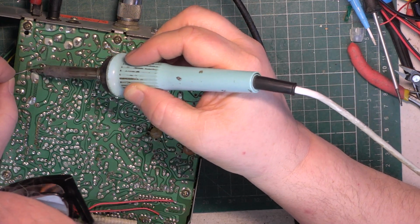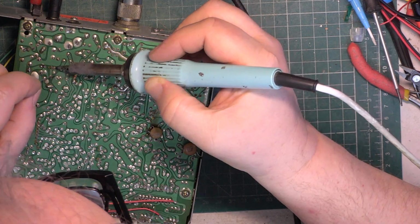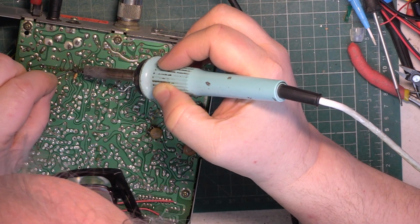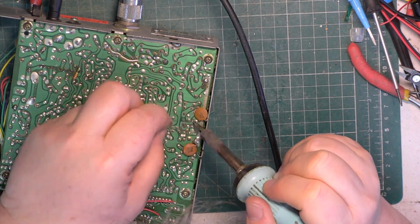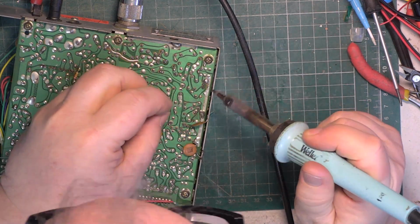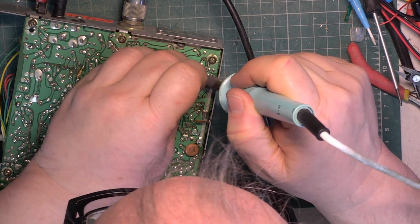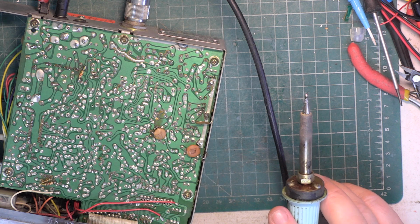You know, I just think this has been used and used until it's failed. In fact, the meter lamp's out. So apart from where the transistors are for the output, which could also go dry joint, hence just checking, that's been soldered up. That filter's potentially dry joint. But they're the hot spots.